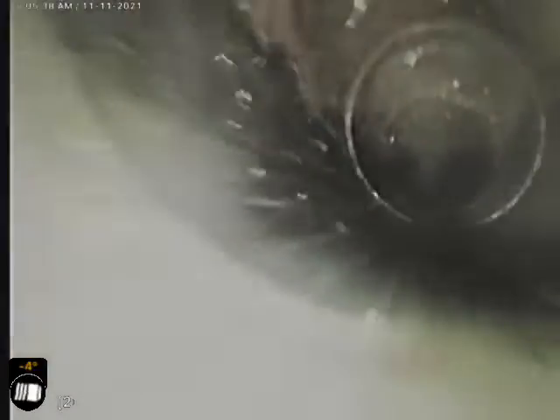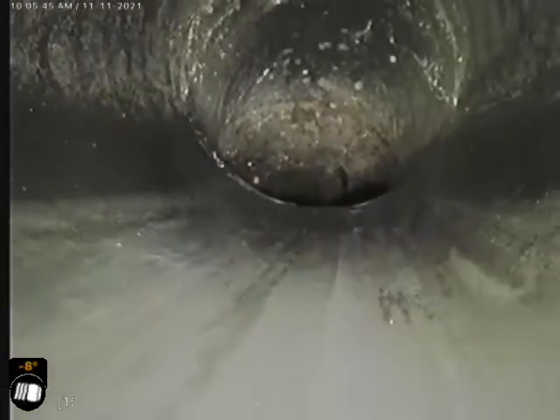Transitioning back to ABS at 22 feet. That includes the sewer scope. We're going to take a video and review it a little bit further to inspect that one section that looks like it has roots grown in, in the concrete pipe at the edge of the roadway, which is located at nine foot one inches deep. So that includes the sewer scope. Thank you.